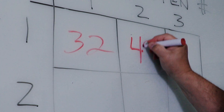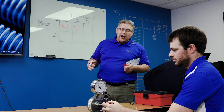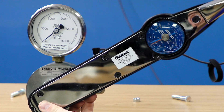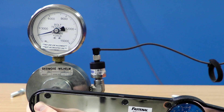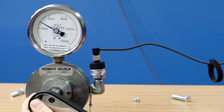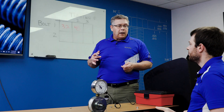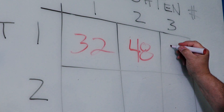Let's do one more. So the third time, we would be removing the oil pan and tightening things back up, or whatever it is we're doing to reuse a fastener. We're going right back up to that same 5,000-pound load. We got 60 foot-pounds.